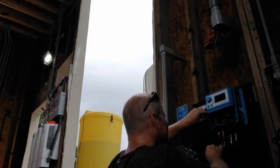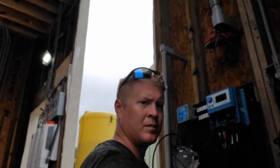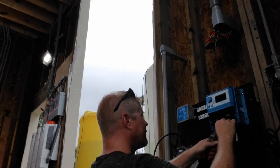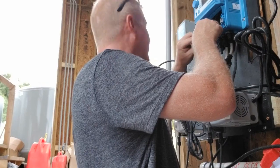It's important that if you're making this modification, you can see I've tied an overhand knot in the wire and then pulled it back down into the gland so that it's secure and won't get pulled out of the controller if someone were to pull on the wire, or if the wire was to fall down and somebody ended up tripping on it or stepping on it.